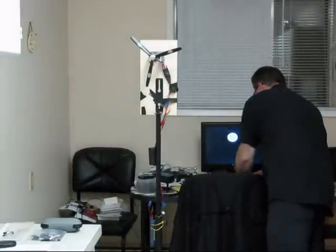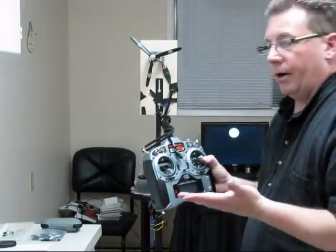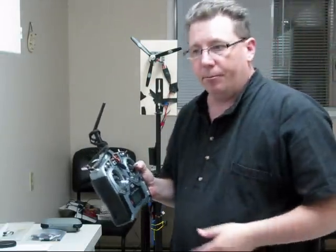On full wind-out, I'm running a peak of 195 watts. The motor is rated for 175, so we're actually in the red zone there — kind of like redline, if you will. Probably with throttle management you could do a quick takeoff, 5 or 10 seconds max, and then throttle back. Or if you have a radio like a DX6i, you could do throttle management down to 90%, which would keep you right below the red line.